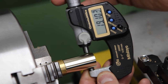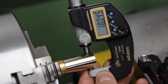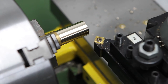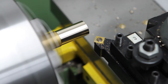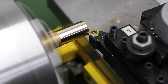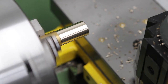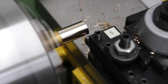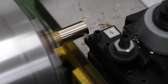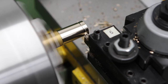I managed to get the dimensions to within about 6 microns — that's about two ten-thousandths of an inch — so pretty close. I'm now changing over to the chamfer tool to break the edge on the end of the work and make it a little nicer to handle. Then I'm swapping out for the round nose carbide turning tool to create the decorative bands on the bead, touching off on the work and resetting the DRO so I can get a precise depth of cut to about 0.8 of a millimetre.